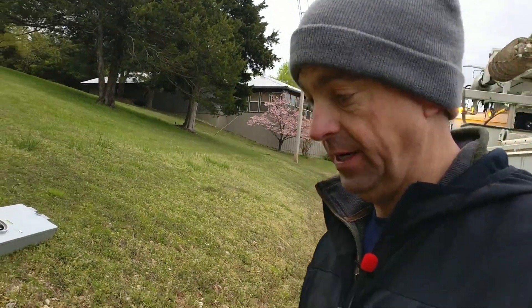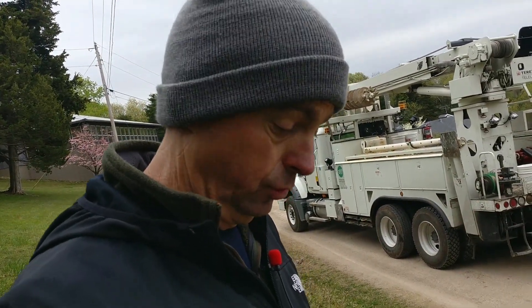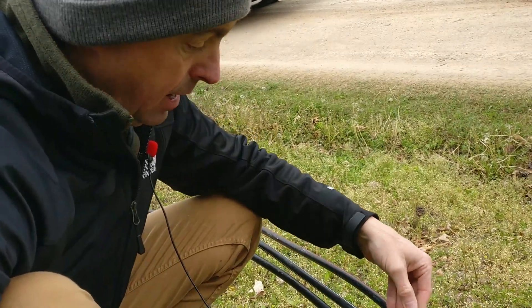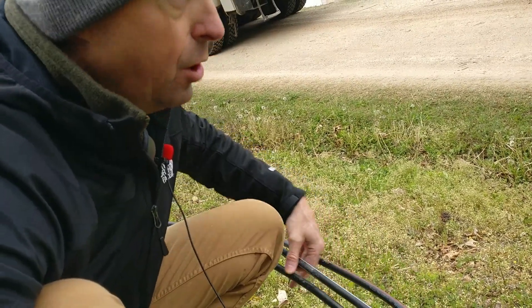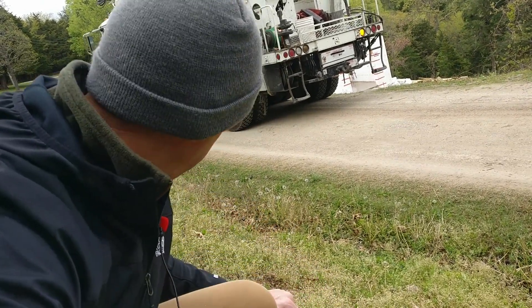Let's go over some basics on the electrical primary coming to the house. I'm going to have a 200-amp primary panel right down there. We're going to have two hots and a neutral. You can see the two hots — this one and this one — and this one right here with the white line on it is going to be the neutral. Coming off the transformer we'll have these two pieces, and then this piece will be more like a ground.